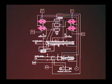There are 4 clutch pilot valves, one for each clutch in the power shift transmission. The pilot valves are hydraulically opened, spring closed, and have the purpose of opening or closing clutch energizing circuits as determined by the selector spool position.